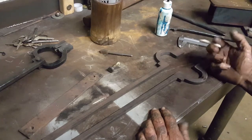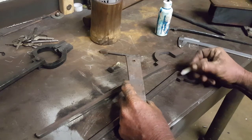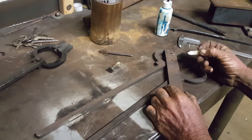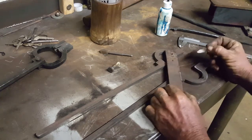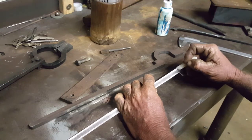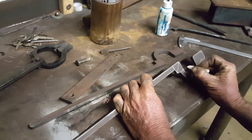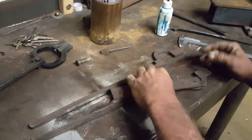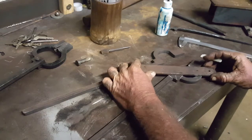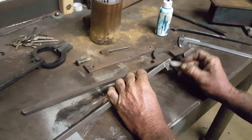You can mark it out just with chalk. We pick up two opposite corners of the boss with a straight edge — any kind of straight edge, whatever you've got — and just mark a line. Then we can pick up the adjacent edge of this side of the boss and the adjacent edge of the other side of the boss. It's really not that critical as long as it's pretty close to the center. Mark that line and where the cross intersects, that's obvious.